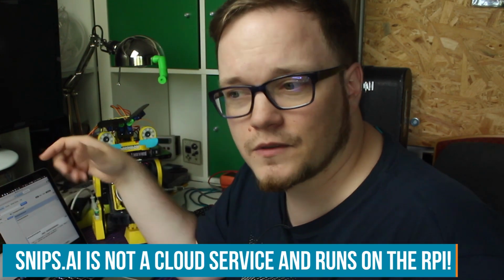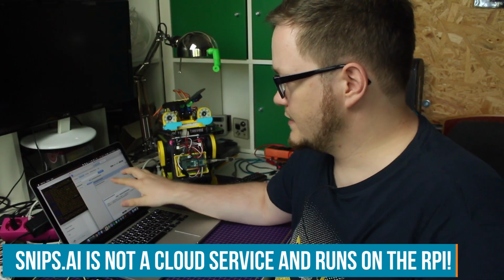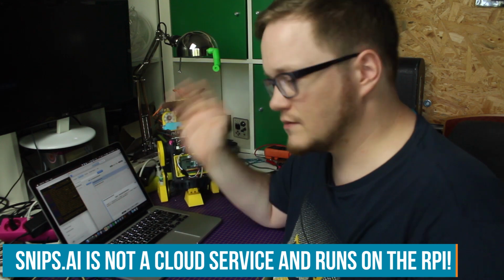Because a Raspberry Pi is very power hungry, I'm gonna use it as a base station. I don't want to draw even more current from the battery that's already driving the servos and the motors for driving around. With MQTT, you can make clients that subscribe to a topic. And in this case, the topic is Hermes/ASR/textCaptured. My plan now is to make an ESP8266 based device that will connect as a client to the MQTT server running on the Raspberry Pi.